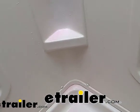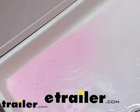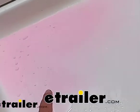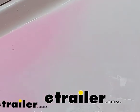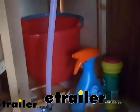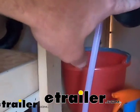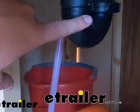Now it may not be a bad idea to go ahead and take some water and rinse this out, because it doesn't smell the greatest, but it'll definitely protect your camper. The other thing you want to keep in mind is this water with the antifreeze in it going down in here, you're going to want to pour a little bit of antifreeze in your shower and in each of your sinks, because you don't want any water to get caught in these traps. So you're going to want to dump a little bit of antifreeze down in there to protect this from freezing over.